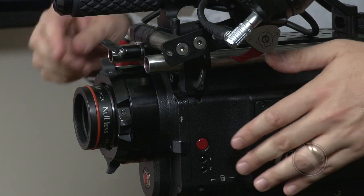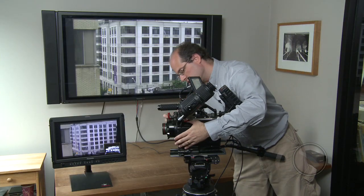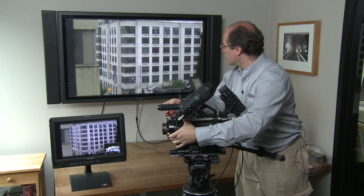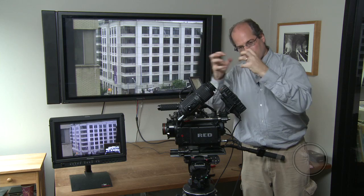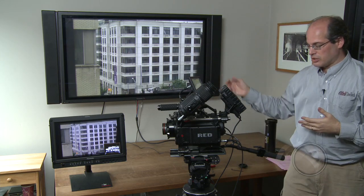Be very careful that when you tighten those down, you're still looking out at the far distance and looking at a monitor to make sure that when you tighten them, you don't actually throw the mount out of focus, because in doing so, when you tighten them, you're actually sort of squeezing a clamp. You want to make sure that doesn't pull the mount in a way that actually throws you out of focus. And you'll know right away, you'll be looking at the image.